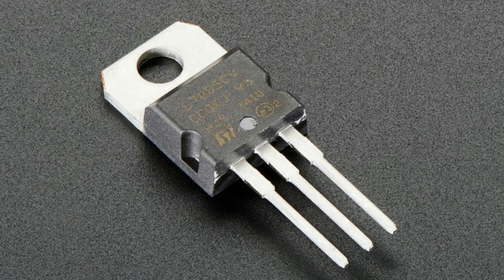This is what it's replacing — the common 7805, 7803, 7812, et cetera. There's many in that family with input, ground, and output. The only issue is they're linear, which means any voltage difference — if you're regulating 5 volts out from 12 volts in, that 7-volt difference times the current has to be dissipated as heat. If you wanted 1 amp out of the 7805, that's 7 watts, and to dissipate 7 watts you absolutely need a heat sink because it's inefficient — you're just burning it off as heat.